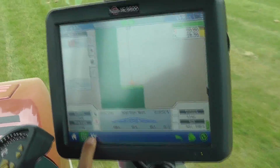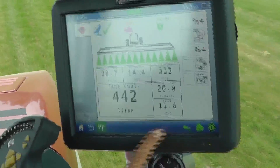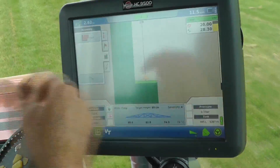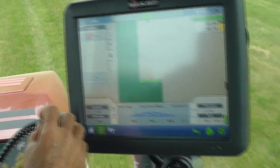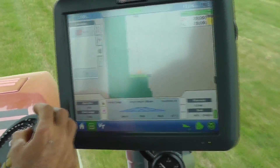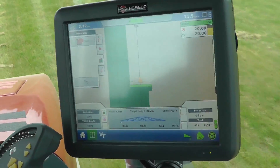I'm going to go to my terminal and see that everything is spraying. It's also indicated by the green bars on the boom. And just to show you, if I manually turn a section off or two, you can see how it's not painting the field as it should, if I've got all the boom open.